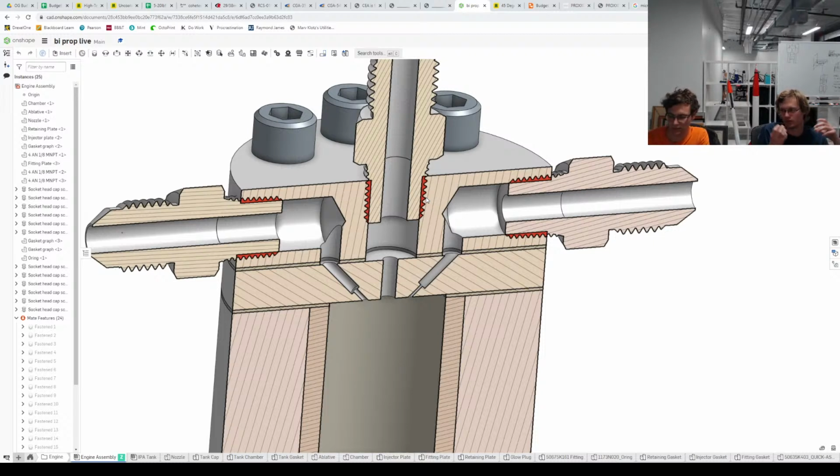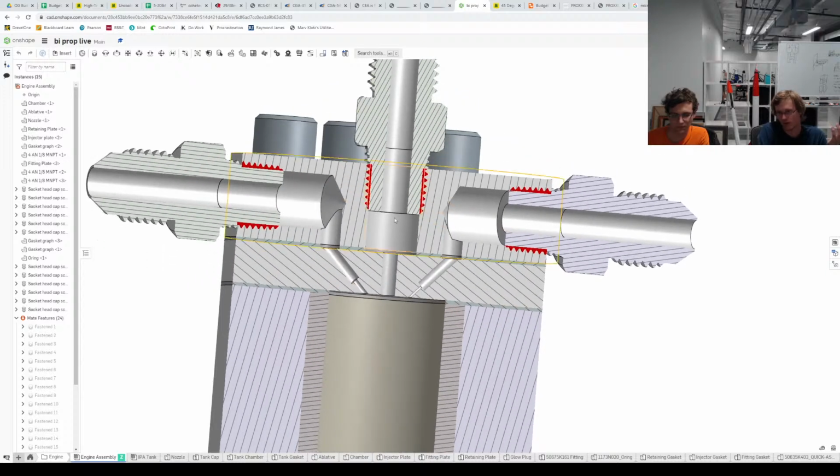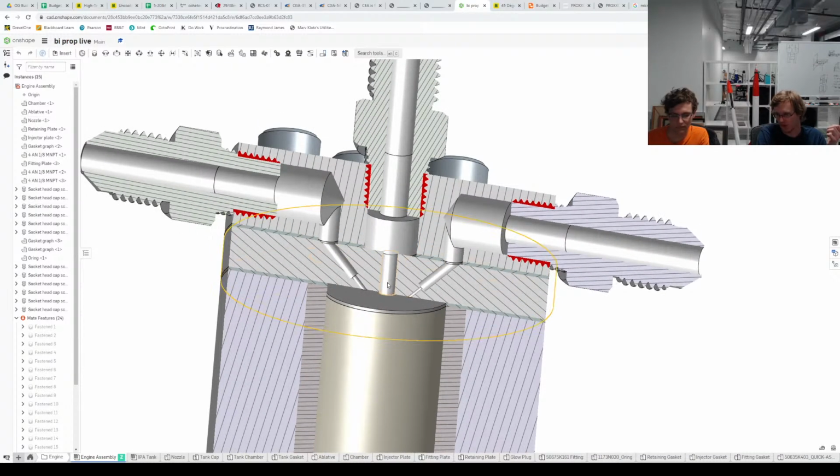the amount of useful threads. So there's a taper cut on the beginning few threads to get them to start, and those are useless in terms of thread use. Yeah. And that's a little bit of space, and then you gotta, I guess you can calculate, hey, would we have enough? But then you have to drill a blind hole into here and then drill a smaller hole, because you only want this little tiny hole coming into the chamber. Yeah. So you'd have a blind hole.